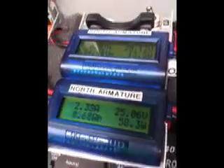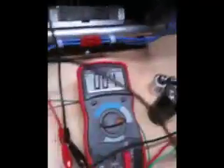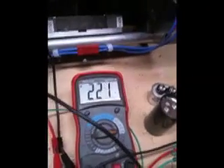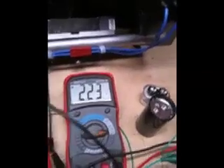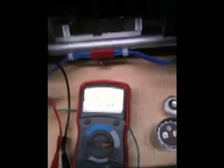Right now it's consuming 2.32 amps. When I load the DC side by attaching the capacitor, we'll see what the voltage jumps up to. Right there it's basically 218 to 222 volt pulses going into the small DC cap. What it's taking to push that current right now is 2.3 amps, and it's 225 volts.